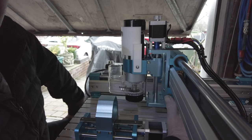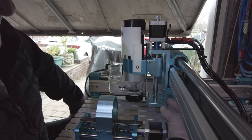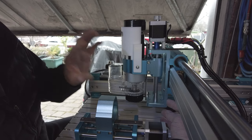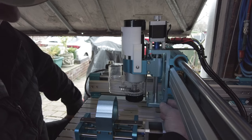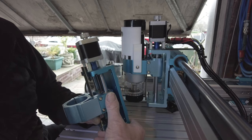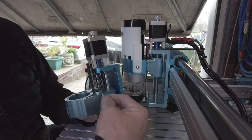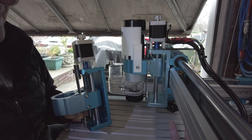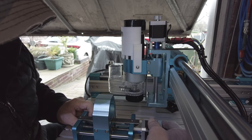Not that there'd be any danger in that sense, but what it will do is it might give you more discrepancies on your engraving or your machining. The whole idea of that upgraded frame was to make it more rigid — and I can honestly say, on mine, it has. I've used it over and over again. I haven't done it in the past three or four weeks because I've been busy with the upstairs cloakroom. I just hope you can understand that I don't think it's wise to swap that. That old part was faulty on mine anyway. Because that part flexes more than the upgraded one, if you put it on there you're going to increase your flexing. So to me, it's a non-starter.